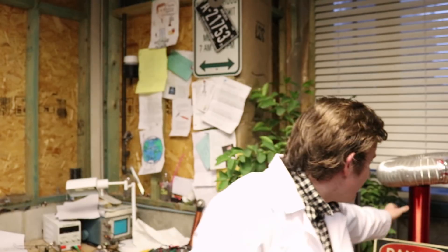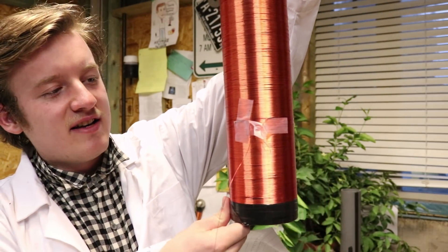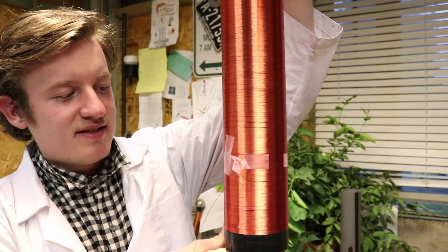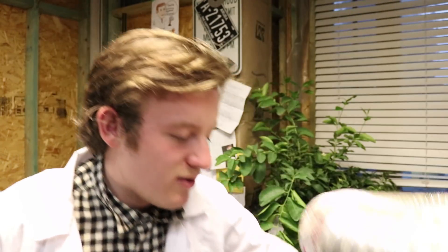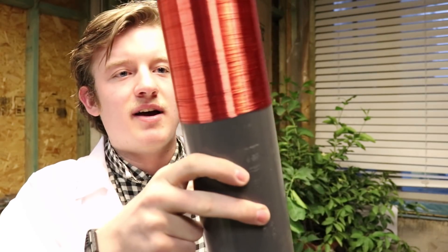But I finally got the letter. He asks, are you going to show us your big Tesla coil? I haven't shown it because, if you look over here, you see that wire there — at some point it fell over and snapped that wire. You can't start it back up with the wire like that, because the high voltage would arc across that point and then carbonize the wire, and more and more of it would continue to degrade and break. So I kind of have to wind a new coil, which I started to do with a lot thinner wire, but then all the wire got tangled up at the top, so I had to cut it short and haven't yet had time to wind another one. But I would like to attach it back up to my old Tesla coil circuit and see what kind of sparks we can get. That's the essence of why I haven't shown my Tesla coil yet — it is broken.